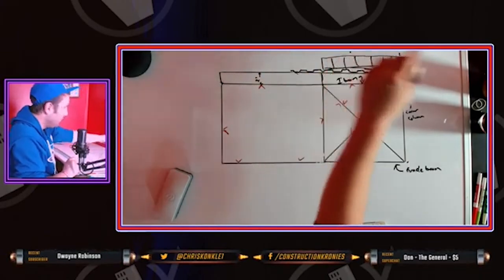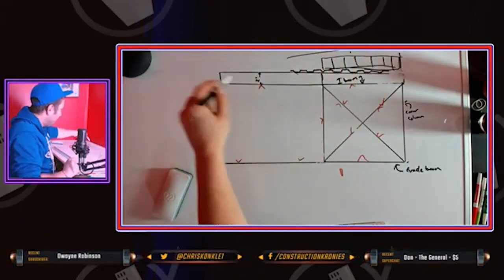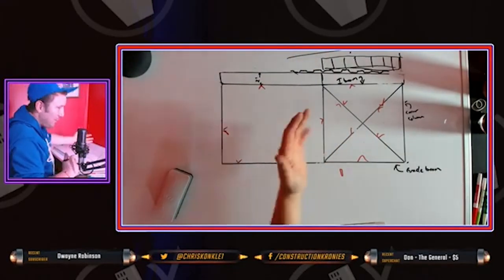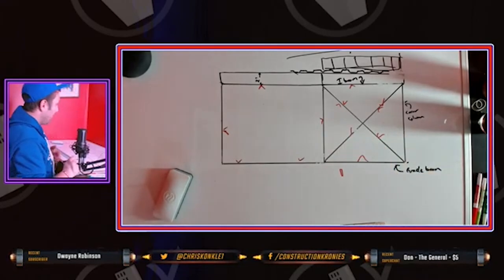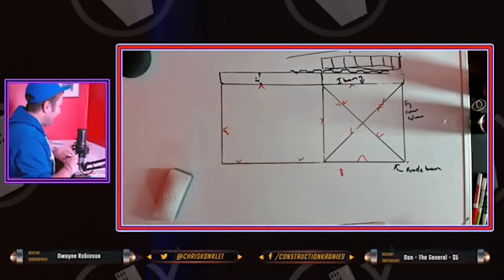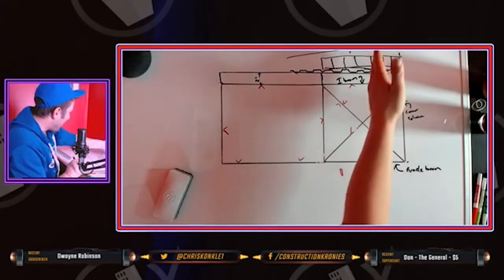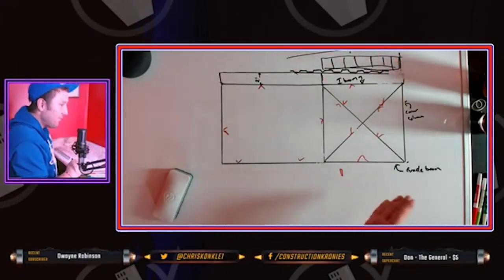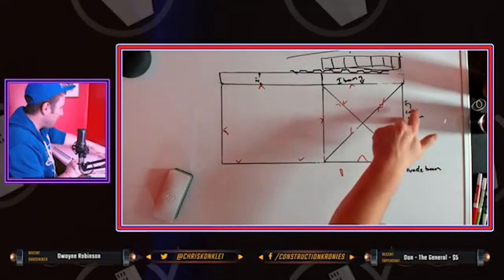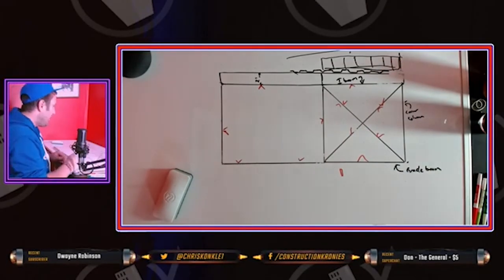This will have a certain elevation. The roof could be sloped, but this will have a constant elevation. So that's where you get the rotator up on the roof. The rotator on the roof for parapets is the bomb for the elevations. You just set it up, and parapets a lot of times are good to do first, guys. A lot of times you'll see the parapets done first. That way, you can just laser down your walls. A smart foreman will actually do that. They'll do the parapets first, and then they'll be able to laser down the walls. It's mint. So think about that.